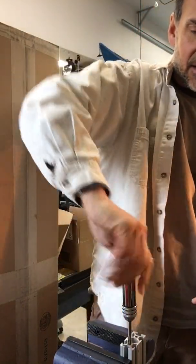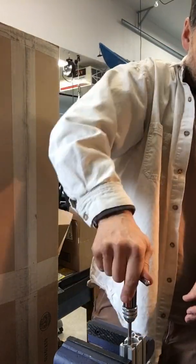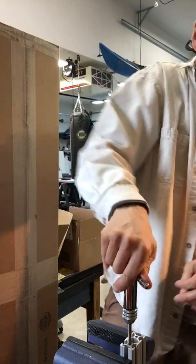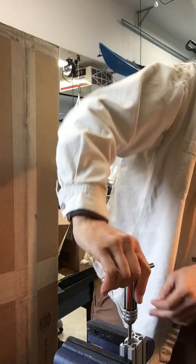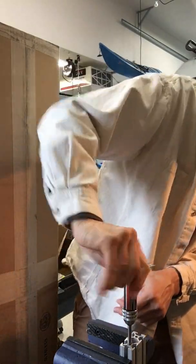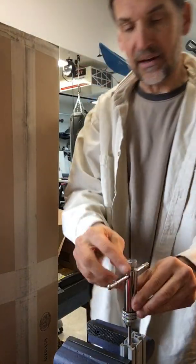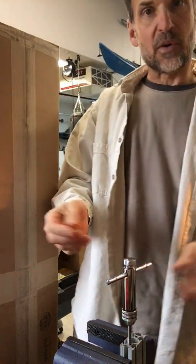I'm not working hard at all to move this ratcheting tap down. This is going to go down a little more than an inch — about an inch and an eighth or an inch and a quarter. You see it's going in very nicely, real nice and smooth and easy, and right down to the end. I don't want to go past the end — I just want to get up to the end. Friction is going to increase as we reach the end because obviously there's more friction with the bit all the way in.